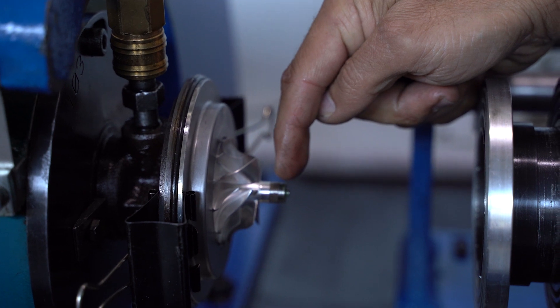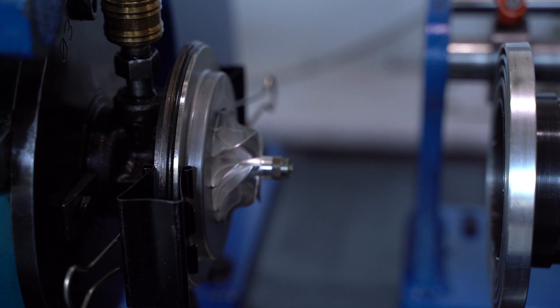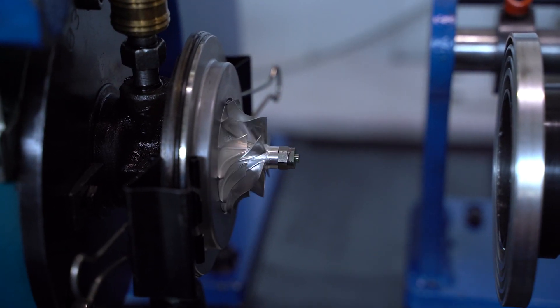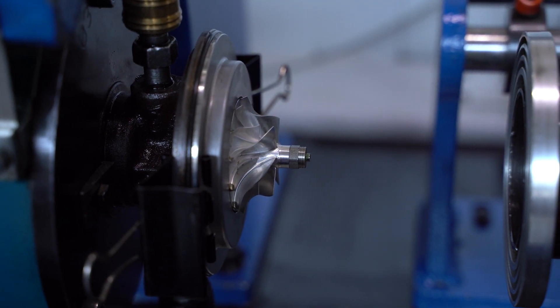Where's the gap gone? The turbocharger, when it rotates, will suck the nut on and actually tighten during operation. You've just seen that as soon as you run a turbocharger at normal rotation direction, a loose shaft nut will automatically tighten. It is not possible for a shaft nut to come off during normal operation.